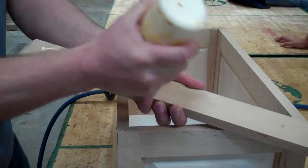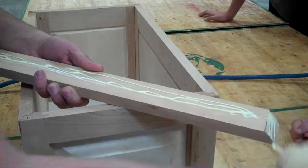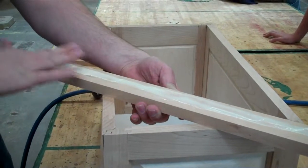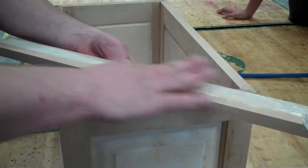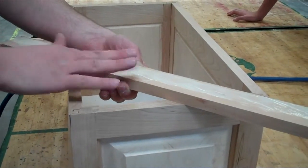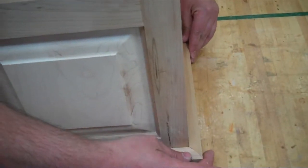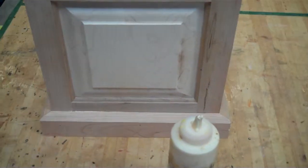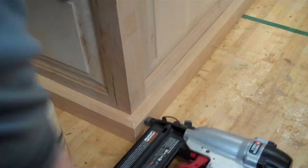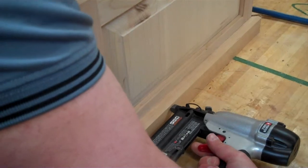On the long ones, just glue it on there, spread that glue around, make sure you get the miters — don't forget to put glue on the miters. Get it nice and tight. These moldings are what makes your project look fancy. If you're too fast and not taking your time and not careful, it really doesn't look that good. But if you get them nice and tight and perfect, that's what people really see and they're like wow, that looks nice. Pin these in on there as well — on the longer ones, do about four pin nails. If you've got a little gap, press on that board to get the gap to disappear when you pin it on.